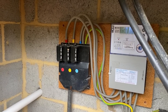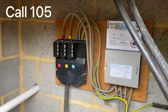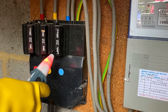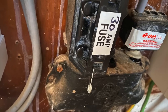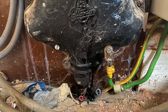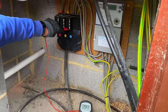What phone number would we have to ring in order to report it? We'd ring 105. This particular problem is classed as an A19. On their regulations they have a graph of different faults with different grades — your A's, B's and C's. Your A's are your top ones, each being a different type of fault, either a broken service head or exposed conductive parts. One of them, which is A19, is your surface voltage — so they're taking it really seriously.